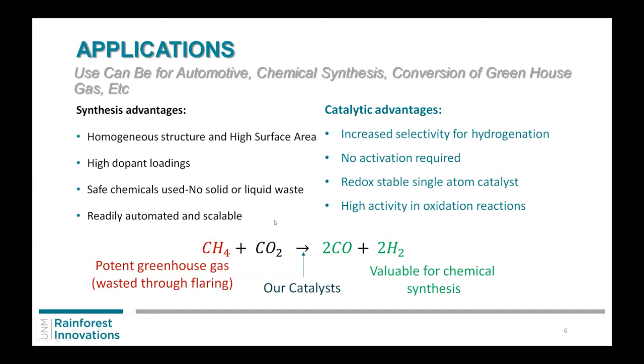We were trying to produce energy through reforming — specifically H2. We've taken this further and mixed methane with CO2, getting good conversion and selectivity with this catalyst. Right now a lot of automotive people need this because they want to reduce emissions and also reduce the amount of precious metals they use. Typically a three-way converter can have platinum, palladium, and rhodium. Platinum is around a thousand dollars an ounce, palladium is double that, and rhodium is very expensive at twenty thousand dollars an ounce.